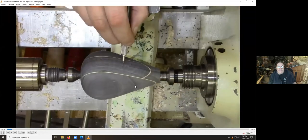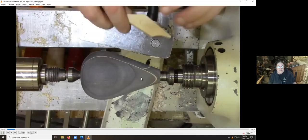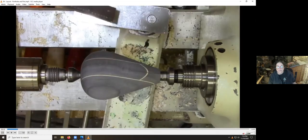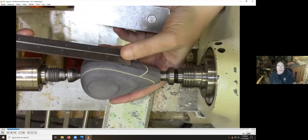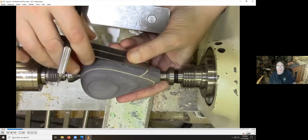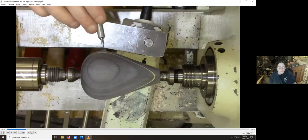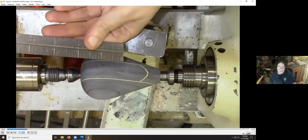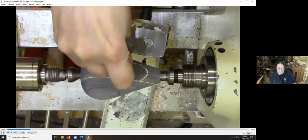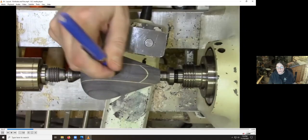This is my fin template. Basically what I'm doing now is laying out where the fin is going to go and putting in marks for the alignment. I'm laying out the lines for the portholes. I've got my box rest set up so that the point of my pencil lines up with the exact center of the lathe spindle. I just line it up on the point of the drive center and then lay it out on the rocket itself where I want the center line to be. In this case I want it to go through the height of that arch, making sure the portholes are after the length of the fin.